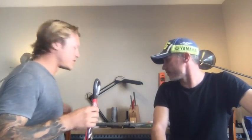So right now we're at $3,600 for the fittings for wire rigging, plus the wire, plus the labor to do it. So it's expensive. So if you're doing Dyneema, that $3,600 in fittings would now be transferred into these types of things, like the fittings that go here, the toggles that go underneath it that connect to your chain plates, the thimbles that go on the top that get spliced onto the Dyneema, and then the whipping that goes in between the thimble and here. That's what we use. This is for the lashing.